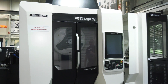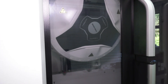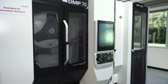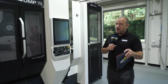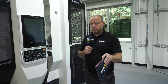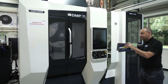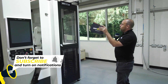The machine itself is a five-axis machining center with a BBT30 spindle taper, but speed is the big thing about this machine — 1.5 seconds chip-to-chip time, 2g in acceleration, and up to 24,000 RPM spindle speed. This is about metal removal, and not just aluminium — harder materials as well. It fits perfectly into the medical sector, and if you want cycle time reduction, the DMP 70's agility and speed is pretty terrific.